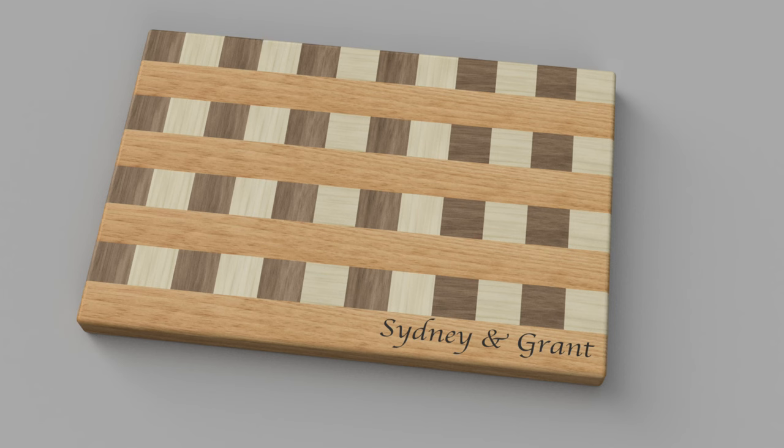In this specific case, the customer wanted the cutting board to be engraved and filled with epoxy. The original idea was to use their wedding colors for the epoxy pour, which was blue, but she ultimately decided to go with pure black for the best contrast. When doing projects like this, I use my Onefinity CNC to perform the engraving, and then I seal the wood using a clear epoxy and a disposable brush. The goal is to stop the colored epoxy from bleeding into the wood during the final pour. The process usually works very well, and I've done it many times before without any issues.